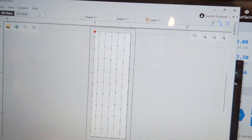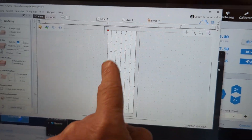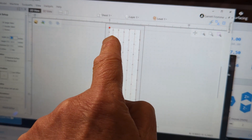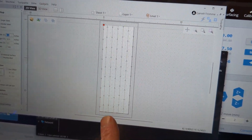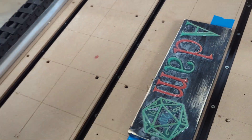So before you go on, here's how Liberty has set up her project. You see the white is the actual project right here, and then she made a rectangle, and the back left corner is her zero XY zero point, and she is surfacing it raster at 90 degrees or up and down. She is staying with the grain of the material.